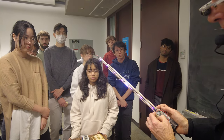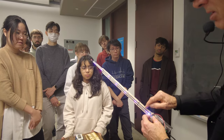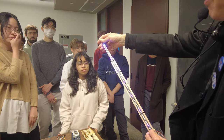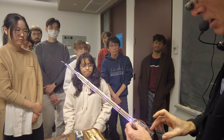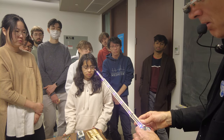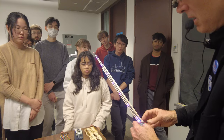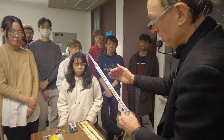The LEDs are numbered from where they're connected — it's a shift register and the data is shifted along. This is the lowest-numbered LED, then next, next, next — these are higher numbers. I've cut the male end off and the female end is where data comes in. As I turn it counterclockwise it rises toward the end; clockwise it falls and goes down.